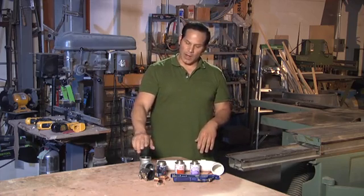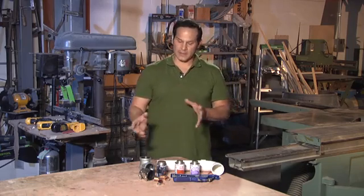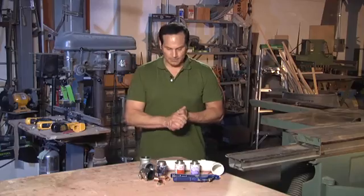Another is that you could go up above the pipe, cut it, and add a Fernco. A Fernco is a fastener that fastens two pipes together. It uses a rubber compression fitting to join it.